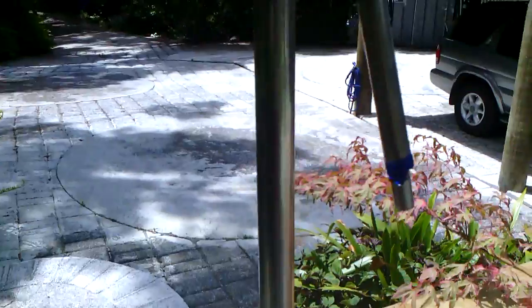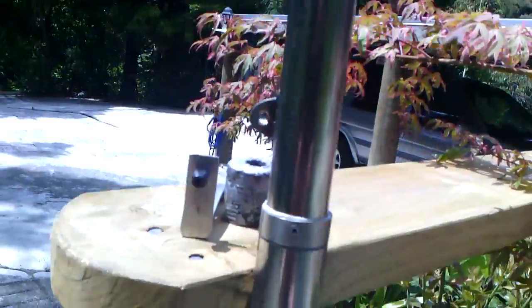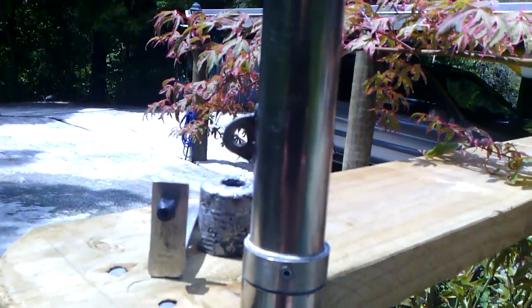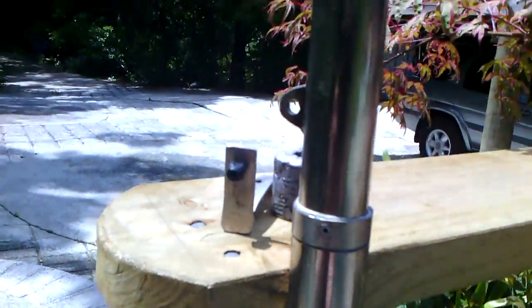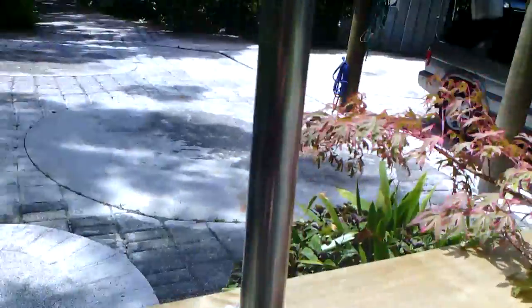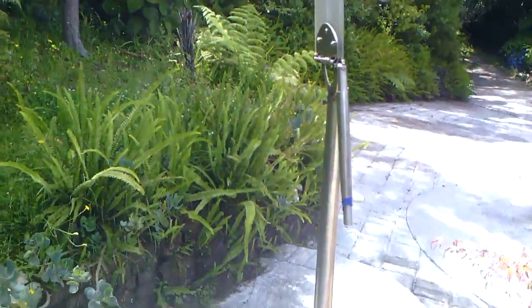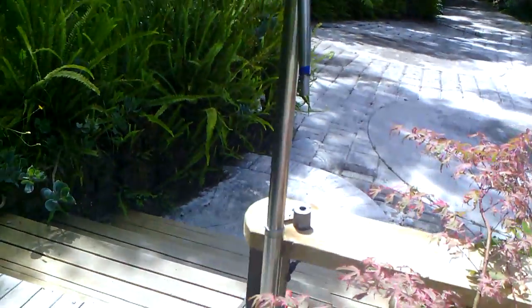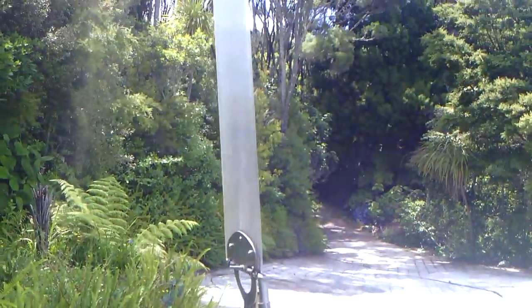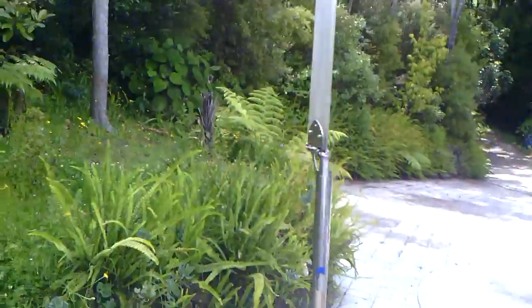Other than I've got a little tab. That little tab there, I have a string or a rope that goes around through that and around the pipe both ways. Then to change the direction, I just pull on the rope left or right, so I don't have to get out the back of the boat. I can have it cleated off where I want, and I just pull the rope and it turns it, and I can get whatever position I want the tab to be in. That's all. Over.